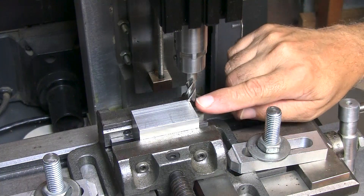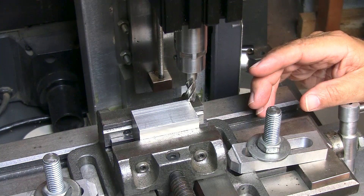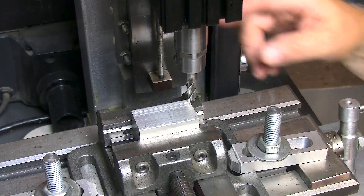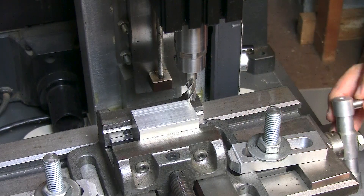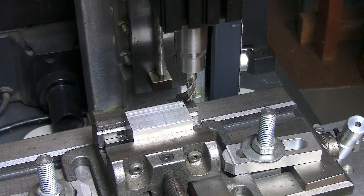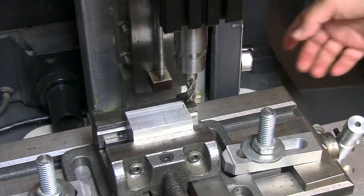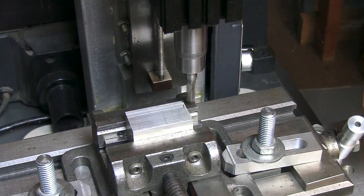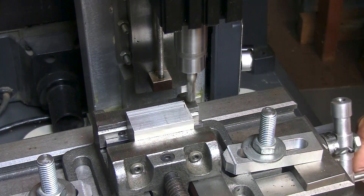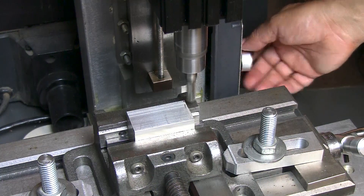I have it kissing the work now. My headstock will travel 50 thousandths of an inch with every revolution of the lead screw. I'm going to move my work piece beyond the cutter, lower the headstock about a quarter turn, lock it in place, and start the motor. I'm just going to take you through the motion — somebody asked to see this thing operating, so here we are.